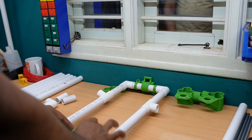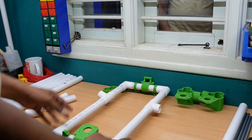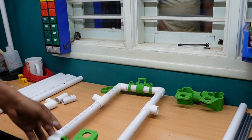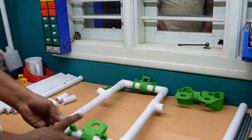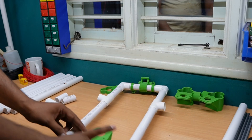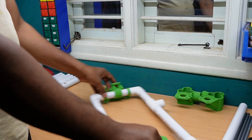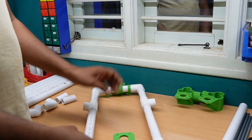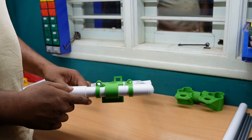Our Y-axis is ready. We have to maintain a 120mm distance between the two Y-axis rods. We use screws for mounting these holders, then we match the exact dimension required for the two Y rods.